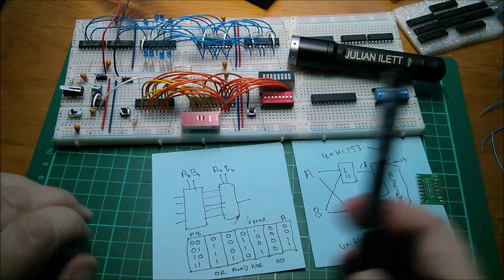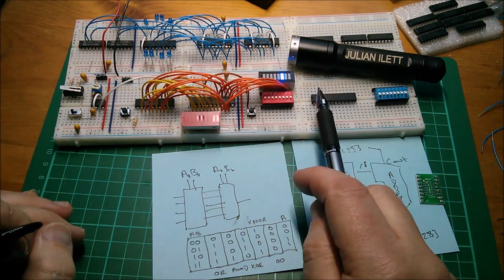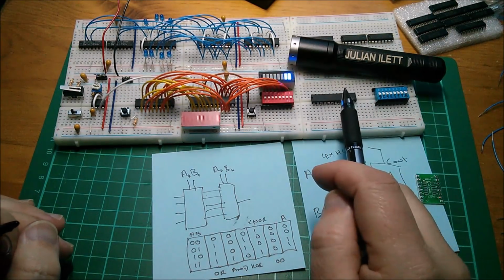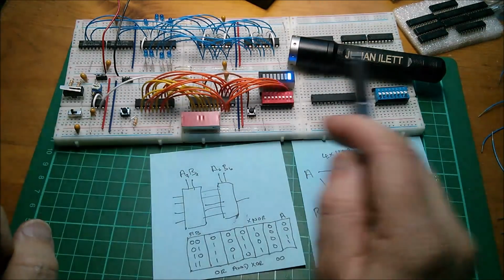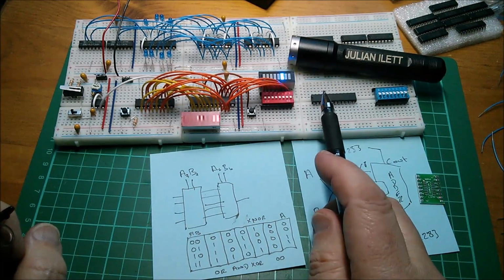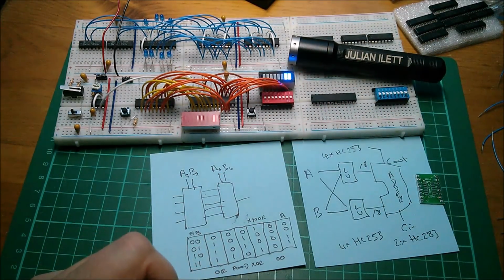And I did think of something, and this was just last night, and it's very vague in my head at the moment, but I did think, you've got 4 bits coming from the RAM as your read latch and 4 bits as your write latch. I did think a couple of the write latches could actually have a synthetic read, which wouldn't read from a latch on the main data bus. It would actually read the read address pattern. And if you did that twice, you could build up a literal in 2 nibbles. It's early stages, but that's probably how I'll have to do it.